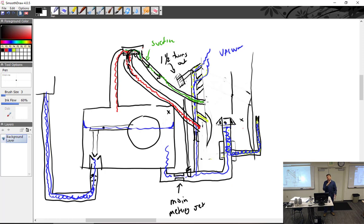I'm getting closer to best power. It's going to go up, up, up. It's going to stop, and as I screw it out, it's going to start going the other way, which means I reached best power and then went on the rich side of best power. How far on the rich side of best power should I go? About 50 RPM. Then you're done. Do you guys follow that?